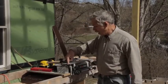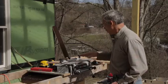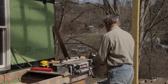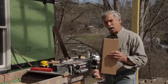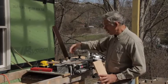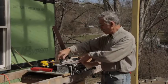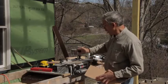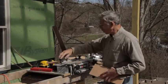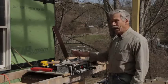Right here is a height adjustment for your through joints; over here is for your half joints. It's important that all your materials are cut square before you start. These are height adjustments so you can make your clamping system work — different heights will have to adjust down at different rates. You want it so that the height is set so when the clamp comes over, it's not in the way of your router. You can screw this down a little bit further so it doesn't lock so high and it's not in the way.